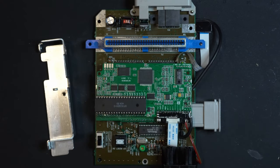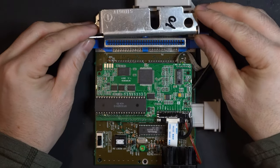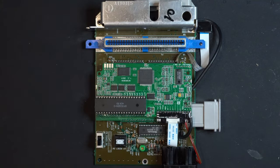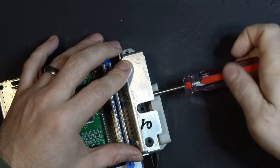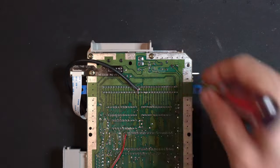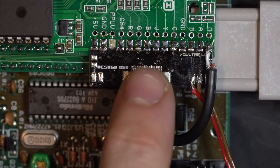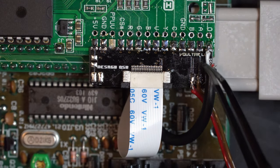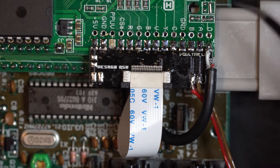That may have even been too much, but that's okay. And now take our heat shield, put that in place. A minor detail, but off camera, I did move the QSB. Originally, I had them up on these vias. It's actually a little bit better to mount them on the pad. It's a lot easier to connect. I just wasn't thinking very clearly.